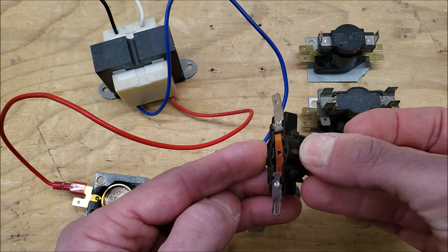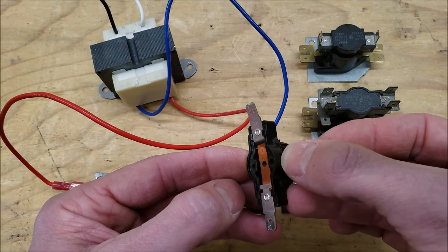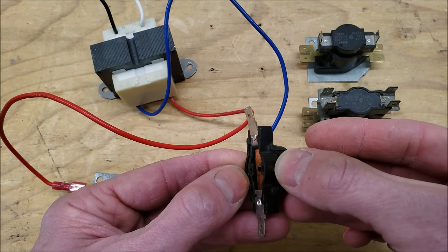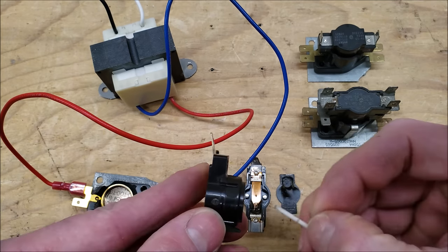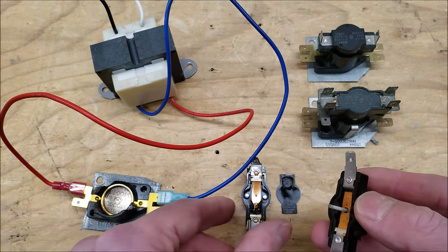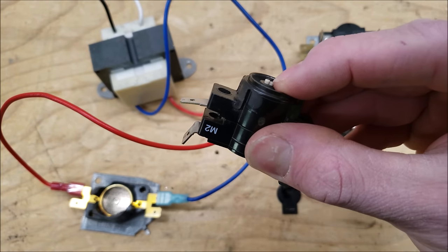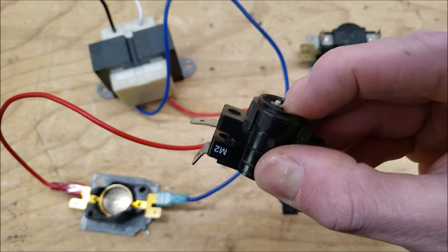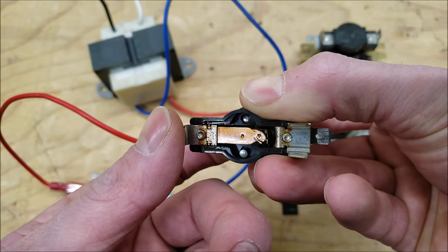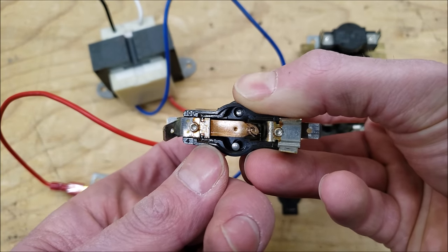After you power it and wait the period of time, it's going to allow that contact to close the electrical circuit. So this is the unpowered state and this is powered after the time requirement. The second rod goes right through the middle and up to the top set of contacts. Both rods are normally pushed inwards so the contacts on top are open until you power the sequencer and wait for the allotted amount of time — then it closes the contacts.